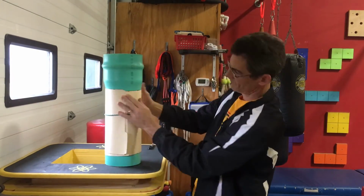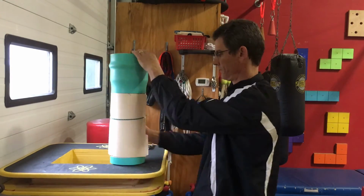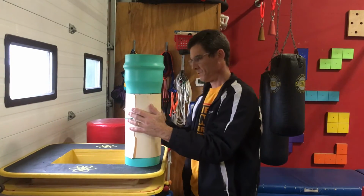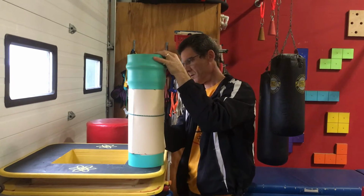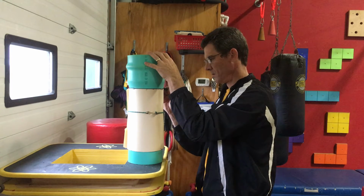Well, probably the easiest thing to do is to get yourself a large piece of paper. I use a couple of manila envelopes that I've taped together and made sure that their edges were nice and straight. Wrap that around the tube. I use a bungee cord to hold that in position while I then align the edges, kind of snug everything up, and I use the manila envelope to guide a Sharpie all the way around. This will give you a perfectly square, perfectly straight cut.